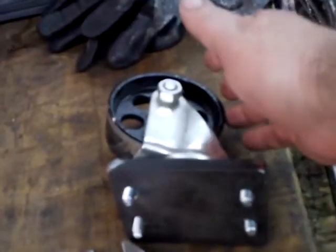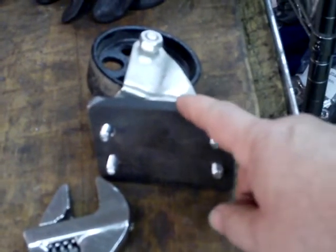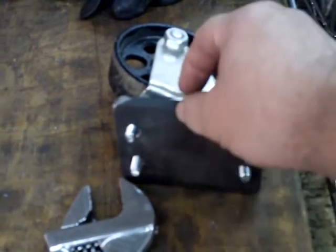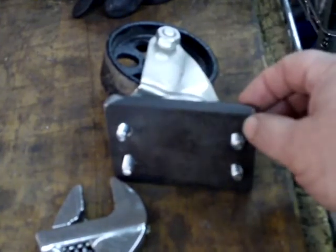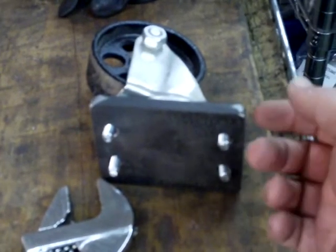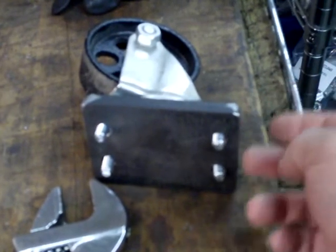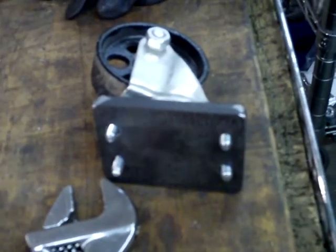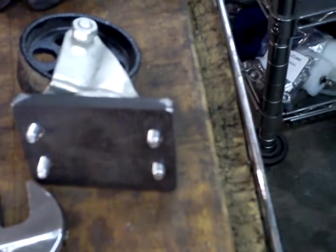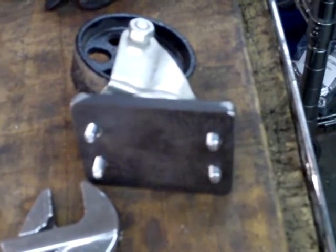These are the wheels — they're steel, about three inches in diameter. This is the base plate, and this is going to be welded onto the other parts. It's essentially a spacer plus a bolting surface because the other parts are two inches wide. If I drilled it, you wouldn't be able to tap it — they're two inches wide. Center to center here is, according to the drawing, 1.850 and 1.185. So if you drilled and tapped it, it would be going into the side of the part — wouldn't work.